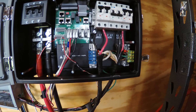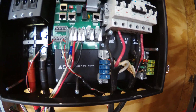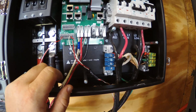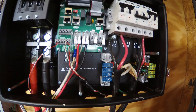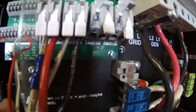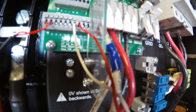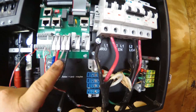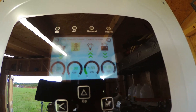A few things are different inside this box versus the indoor unit. The positive and minus terminals are flipped, so make sure you read the labels. Regarding the input slots: on the indoor unit, slots one and two were the battery temperature sensor and nine and ten were the generator remote start. On this outdoor unit it's labeled differently — generator start is on slots seven and eight. Always read the labels; don't assume that even the same brand and same tier of product won't have those little details changed. I've got my PVs from MPPT one back online and we're pulling solar.